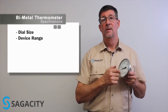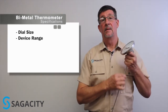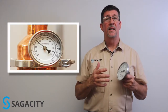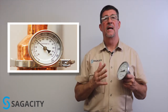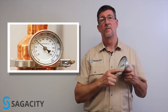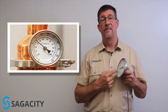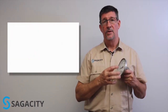The range of the device is another consideration. Because we have a bi-metal helical strip in a tube, there are some mechanical considerations in that. You can only cover about 600 degrees of range — you can't get much more motion out of that helix. So if you're going to specify a range maximum temperature reading of 800 degrees F, you're probably not going to see temperature much below 250°F with that device. When you're specifying these, you need to take into consideration that you have a limited range.